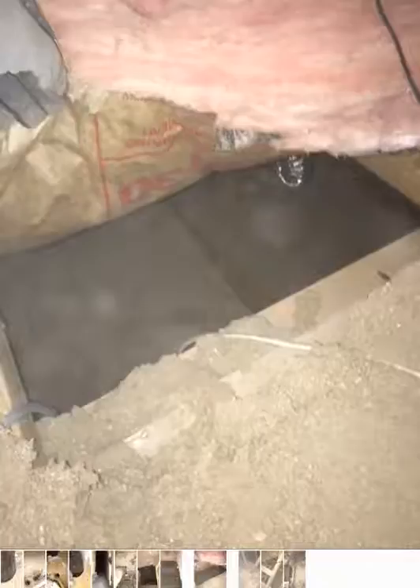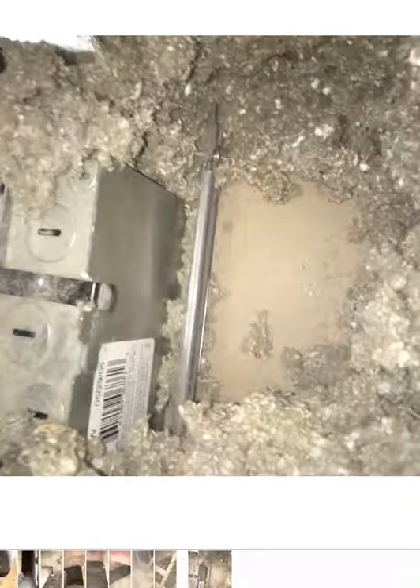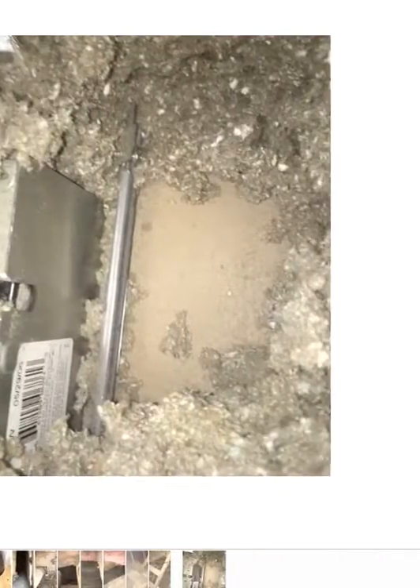There's another spot where that insulation is not doing anything. Here's another side of that same attic — it doesn't matter how many batts you pile over the top of it, the issue's still there. You're just burying it. Look at that — big old soffits. Terrible. So you want to be able to get good pictures of that. There's another can light, just showing you that it hasn't been sealed at the floor joist.